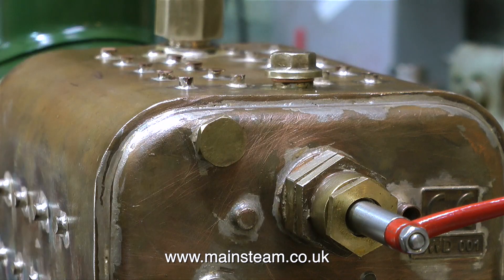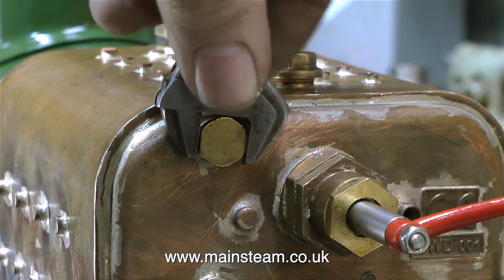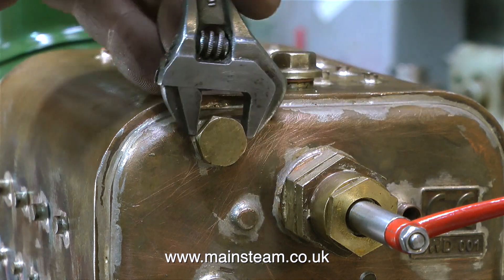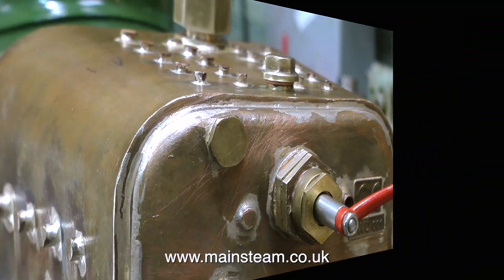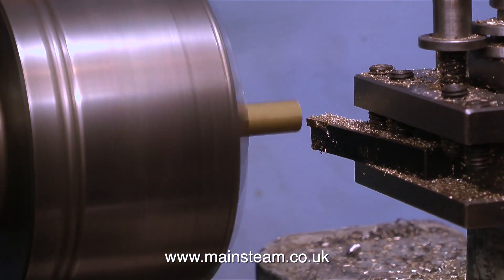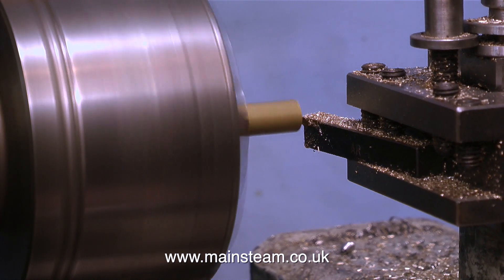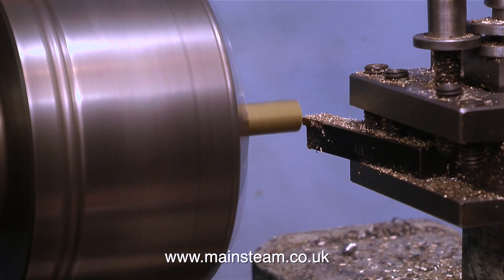What I'm doing at the moment is fitting blanking plugs to the boiler. This is to make sure that no water leaks out when we pump it up to 160 pounds per square inch with a hydraulic pump. The idea of testing at twice working pressure - because the working pressure is 80 PSI - is to make sure that the boiler is fit for service. It's no good testing it on steam, because if it isn't, you'll soon find out about it as it goes bang.